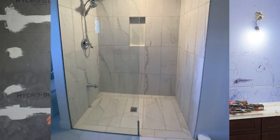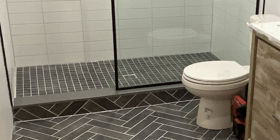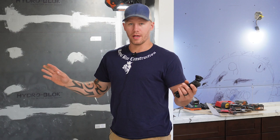Another thing to factor in: the most common thing in a bathroom is a bathtub if you have kids. If you don't have kids you might consider just doing a shower. Your options there are curbless — which is kind of what we're doing here, very sleek and modern — or a curbed one, which is essentially a dam that keeps water contained. You usually have a panel and a door. With curbless you have the option for it to be wheelchair accessible, or you can do no door and have a wet room. Factor in more waterproofing if you're doing curbless, wet room, or even a steam room.